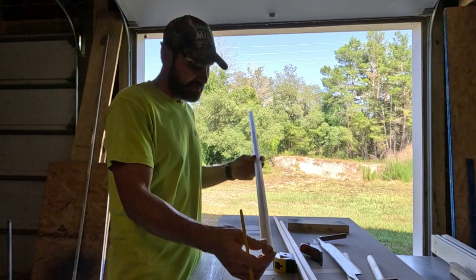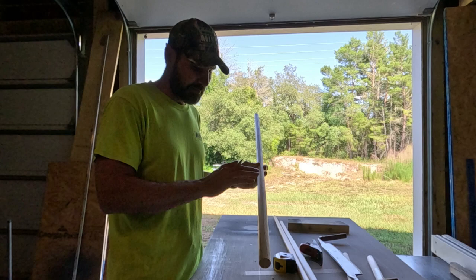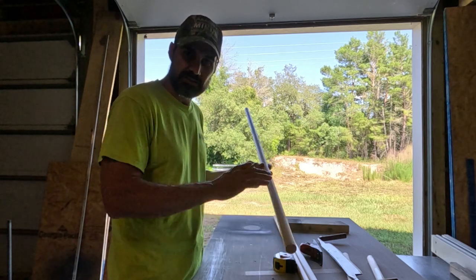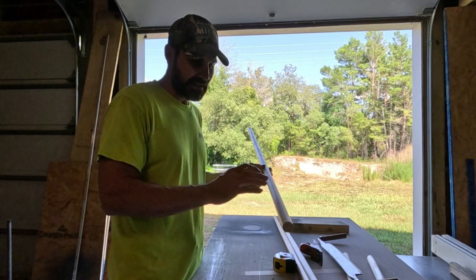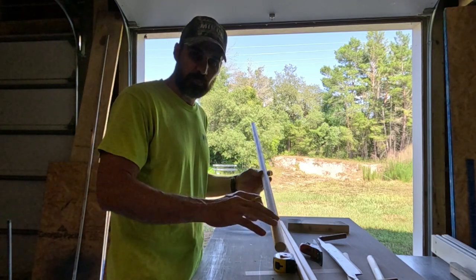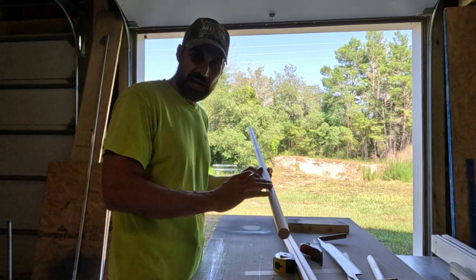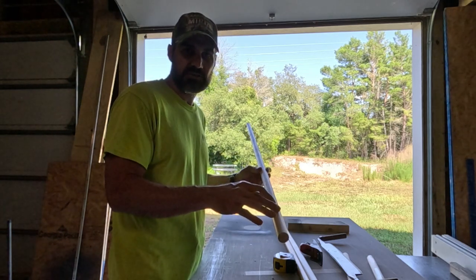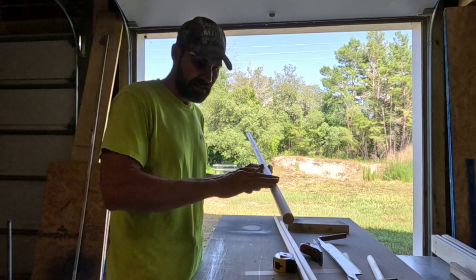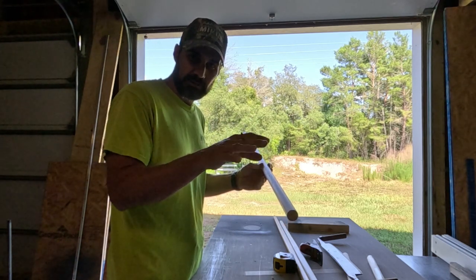The way that I'm going to do that is taking it off in quarters. It works really well. Put it in the vise, work down the top part of it, and then rotate it 90 degrees and take it off again. That gives you 4 even sides. Then you can come back in the middle part and take out that quarter material, but you're working back to the ones that you already established as far as your taper. So now you're putting the plane on there and trying to match it so that that next part is going to be even as well.